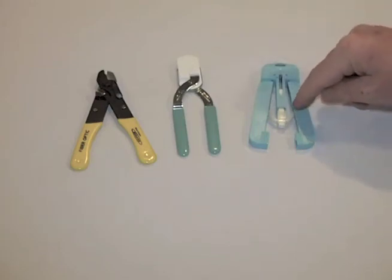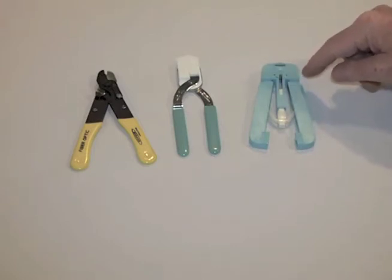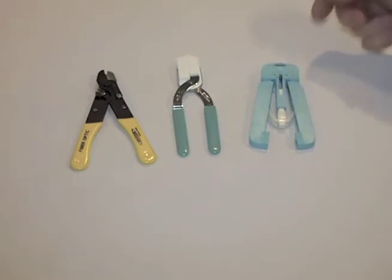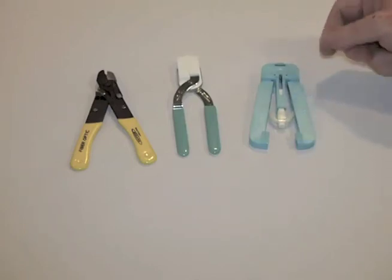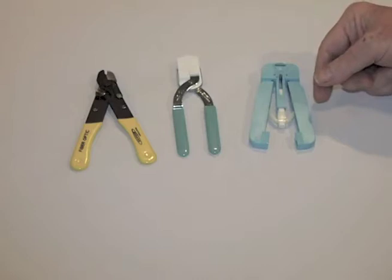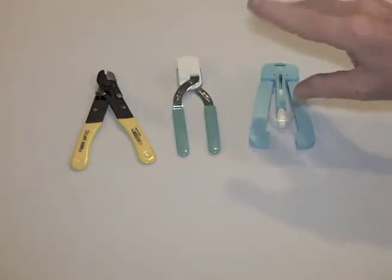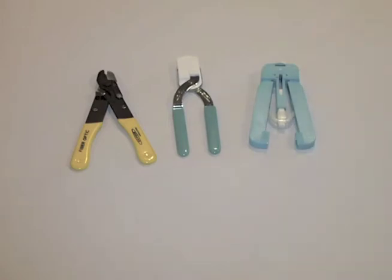And this is what's known as a micro-strip. The micro-strip is one that's often liked by fusion splicing people because they can strip a longer length of the primary buffer coating easier than with the others, where you sometimes have to take a little bit off at a time. So let's take a minute and look at how these actually work.